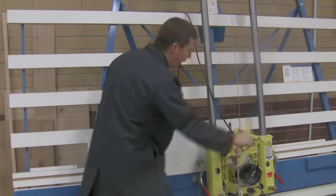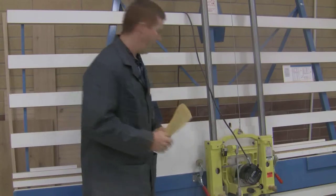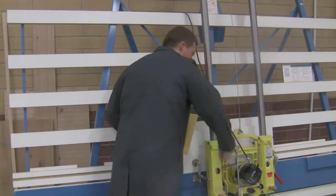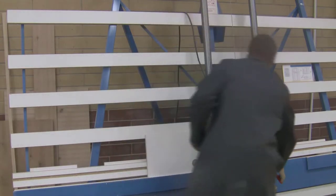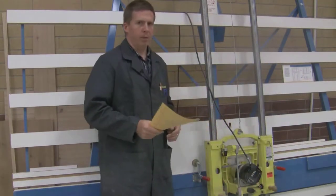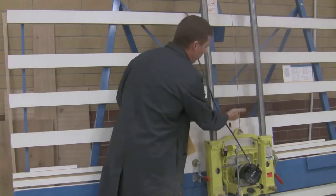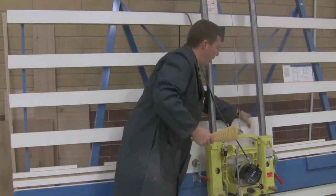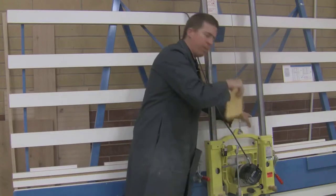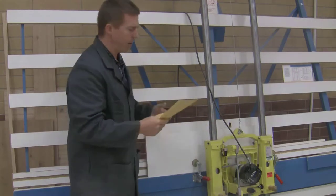We need to use the two clamps — there's one here and one there, both with red handles. If possible, clamp it with both, but at least have one clamp. Lift straight up — it's easy to pull out the knob, but lift straight up and you'll feel it click in place, then reach over and click the other one as well. Two is better. If I have a smaller piece of wood that I'm afraid will start lifting up, go to where all my clamps are and put an extra clamp there for support to keep it down on the ledge. Better safe than sorry.